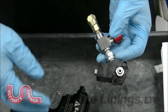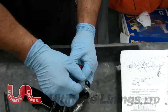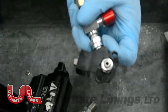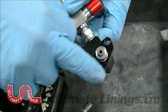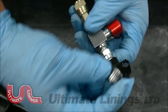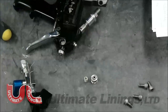The B-side is rare that it actually does it. But if you have to take this off and rebuild it, use your 13 millimeter and unscrew it. There will be times you'll have a tough time, so you might have to grab a propane torch and lightly heat it up because ISO does catalyze with moisture in the air. Inside you'll find your side seal, spring, and dowel ring seal.